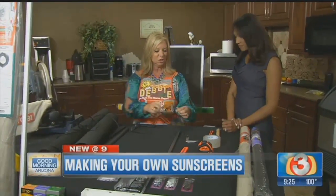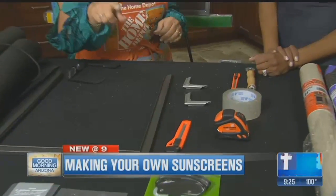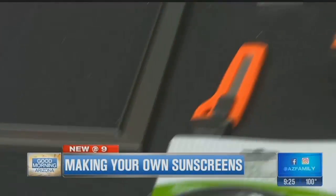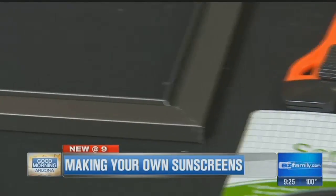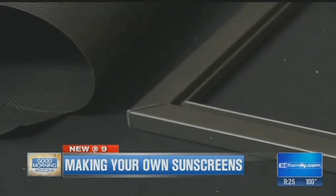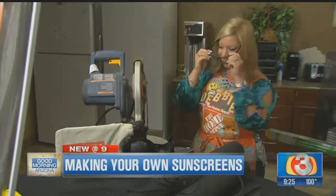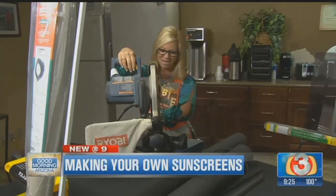But with this frame, they don't have pre-made corners, so you're going to use corners like this. We need to miter the corners on this frame, which is a 45-degree miter. You can use a hand miter saw, but it really comes out nice if you use your chop saw. You want to make sure you use protective eyewear — or step out of the way.